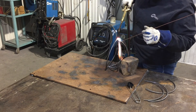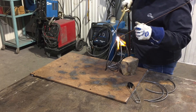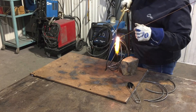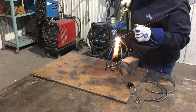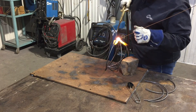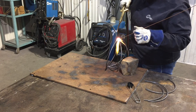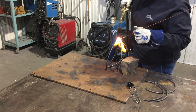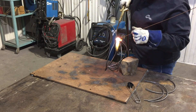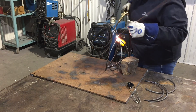Remember, cherry red is not enough. You need to get it to the point where you see that liquid puddle or that shininess, and when you do, you can feed your welding rod in between the flame and what it is you're welding. If you want to see more clearly what's actually happening when you're welding with oxyacetylene, watch the video from week four with This Old Tony, where he shoots his welds through a filter so you can really see what's happening with the flame and the drips and the little stack of dimes of metal he is able to build up.